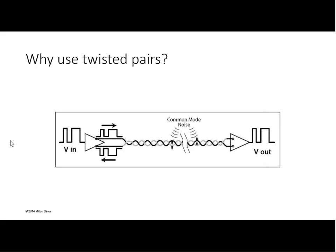They can be at 0 volts, they can be at 3 volts, they can be up to 5 volts. But the question is the difference between them. For a positive signal, the positive pin will be higher than the negative pin. For a negative signal, the negative pin will be higher.